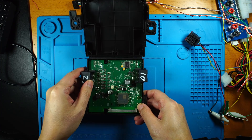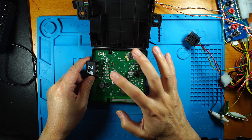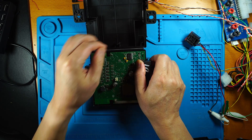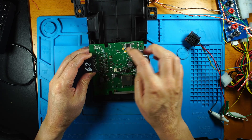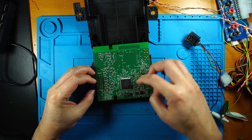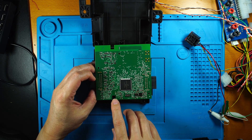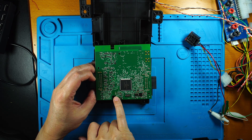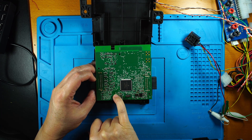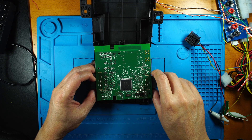The second board has the same CPU layout as the first one in terms of memory. If you want to read and access it, use the same configuration. But this one does not have a visible BDM port on the front. If you flip it over, there are six pins used for BDM, but the pinout is different — on the left is ground, the second is the background pin, and the third is the reset pin.